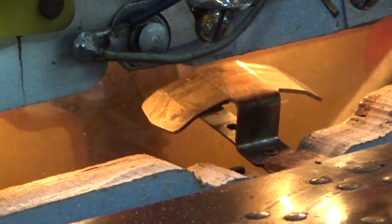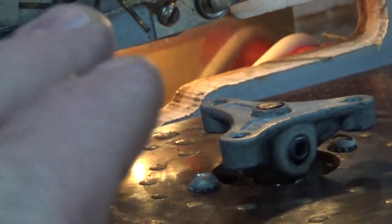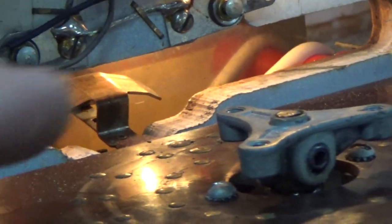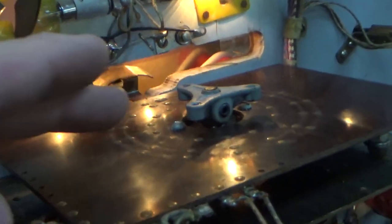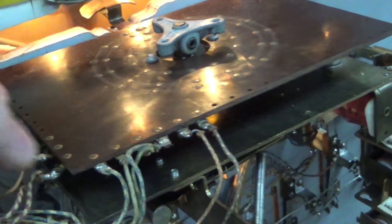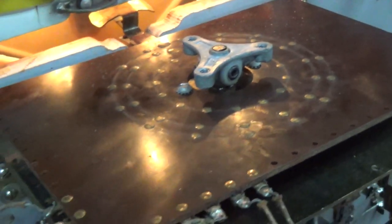There's only one switch. So when you hit the plate, whichever plate is in the middle just happens to be the one that hits the switch. So once it rotates to the number two, that two will be up, and when you hit it, it just hits the same switch. And the switch is just wired into all of these rivets, and so the little fingers that move around, they're on one of these places and will either score 1, 2, or 3 depending on what they're touching.